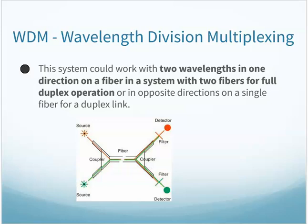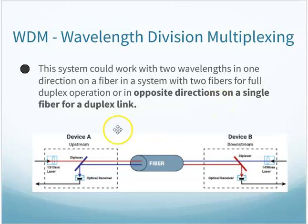In some cases, with specific circuitry on a single fiber, you can send a signal going one direction and it's read on the far end, and going the other direction you can send a signal back. Using filters, you can filter out the signal you don't want to see. This is the kind of thing used in fiber to the home passive optical network — the downlink to your home and the uplink back, sending control signals like channel requests. You have downstream and upstream.